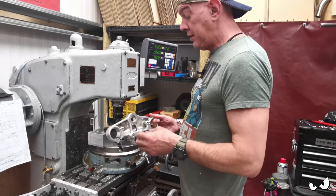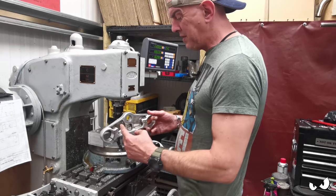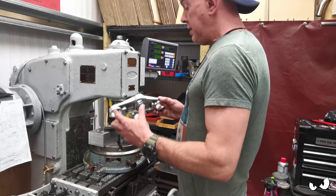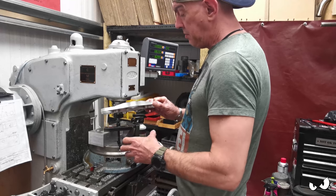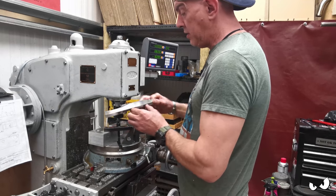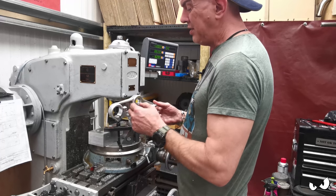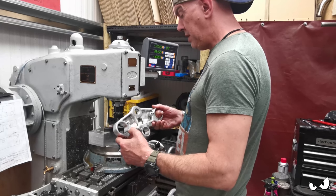This is the standard Daytona top yoke. As you can see, all the underside is open, whereas ours is going to drop down at 45 degrees like this. Now, I've just offered this up to the bike, and obviously we've got frame tubes and various other bits and pieces coming out the back of it, and I don't want there to be any issues with steering left and right. I don't want this to be bashing into the frame, basically, so we're going to need clearance.